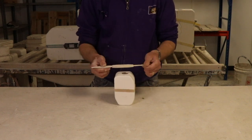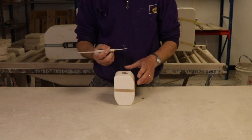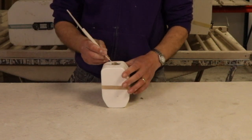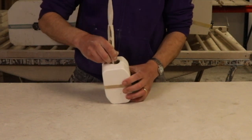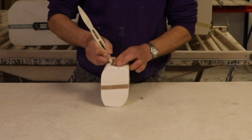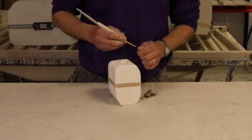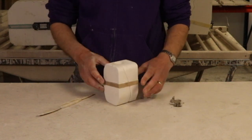This tool is a plastic tool we know as a Lucy tool — I can't tell you why it's called that, I have no idea. The idea of using a plastic tool is that it's not going to damage the plaster of the mould. You don't want to use anything like metal on plaster because it'll just cut into the plaster and you end up with little bits of plaster in the clay. So I'm going to use the tool just to get into the pour hole and cut off the spare from the bottom of the piece — it just gives you a nice sharp edge to the bottom. Keep all that spare clay; we can reconstitute it. Nothing wrong with it at all — perfectly good to use again.